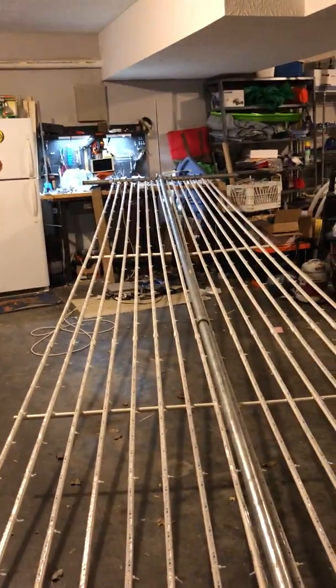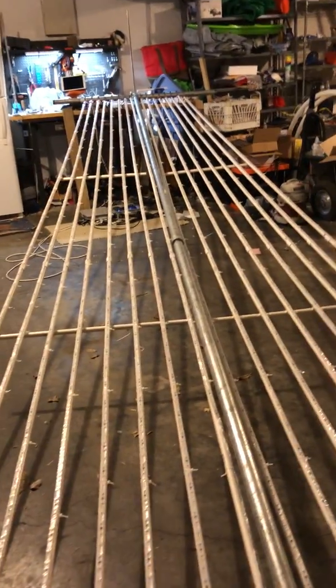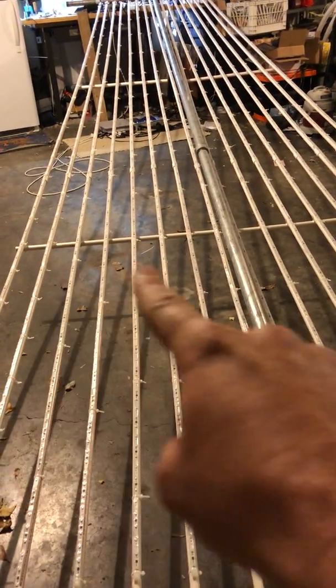And so everything is, again, you can see, it's flexible, it moves. But these rubber things, the best part about them is, these aren't going to be perfect when you first attach them, so you have to space them out. I believe I started with 2.5 inches of spacing at the very top, and then you'll see there's a couple of sections in the middle where I used spacers, some extra PVC with some clips on it to make spacers. So I went 2.5, and then the first set of spacers that go across there, that's 3.5, and then I came down to here, these are 4.5, and I think I ended up around 6 inches at the very bottom for the spacing. So that's that. Now let's light it up real quick and see what it looks like.